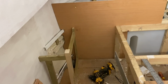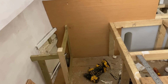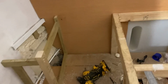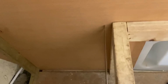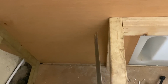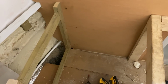So now I'm going to start putting my boards down there. I'm going to see if I can conceal the screws. On this side they're going to be concealed by the door going in, by the drawer, sorry. That's going to hide that because there's going to be an 18mm face on this drawer here. So as long as I put the screws in the oak panel there, then that's going to be hiding it on that side. On this side here, haven't quite worked that out yet.